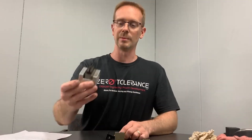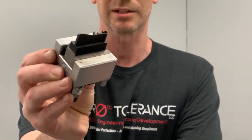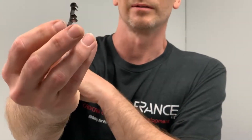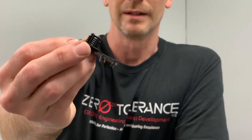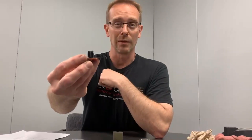So what we do is we make an electrode with features like this. What we do at Zero Tolerance is we build plastic injection molds, so most everything we do here is done with EDM in some way. This is a particular part made to hold some kind of wire harness. This particular part has a very unique shape — it's a clip that pushes into a piece of sheet metal and holds some wires. We're going to talk about this shape and actually show how that's done in a block back there on the machine.